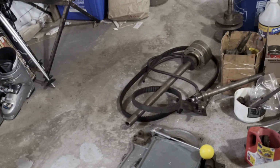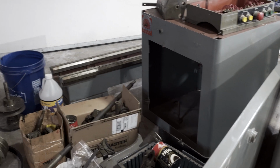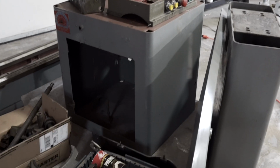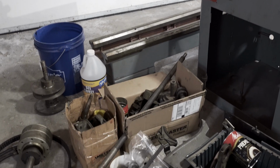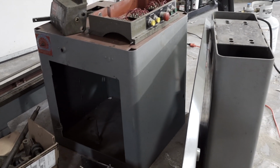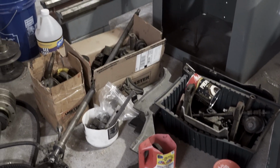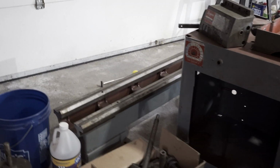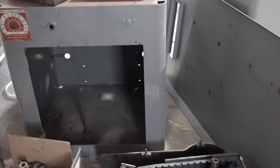And then I think what I'm gonna do, rather than get the variable speed drive working again, which I've heard is really finicky, I think I'm just gonna CNC this machine. It seems like it'd be a good fit, right? So turret lathes don't have a tailstock. They don't have steady rests. They're missing a lot of things that make engine lathes nice, but they're designed for production, and they have a lot of amenities like the rotating turret. So I think this would make for a really nice CNC conversion, especially because one of the things that is missing, I don't have a motor. It does not come with the motor, and I knew that up front. It also doesn't have a chuck, but that's a separate issue.